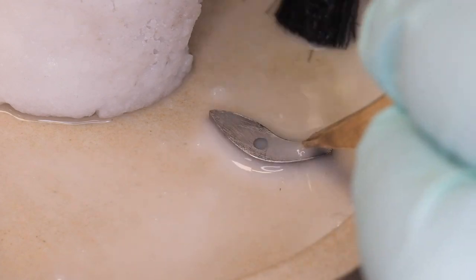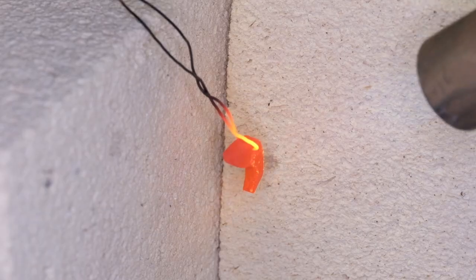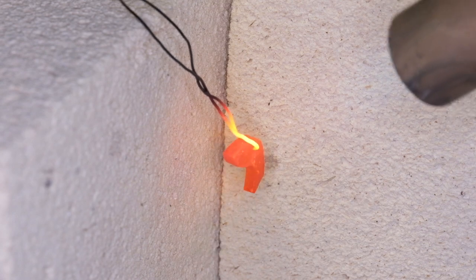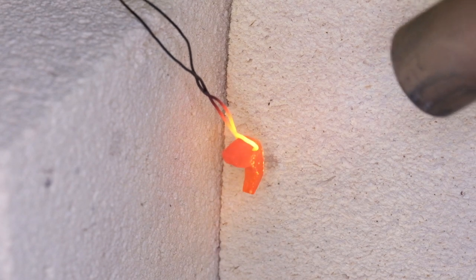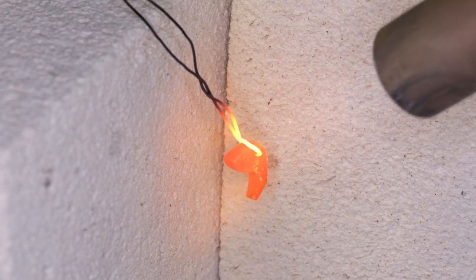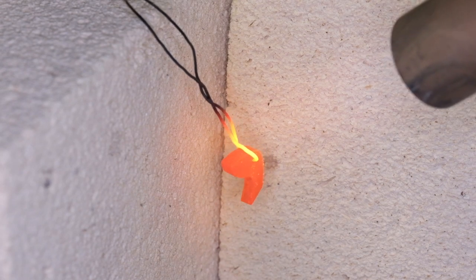The component is now ready for hardening and tempering. To help prevent fire stain — that's the oxide layer that builds up on material when you heat it — I use a borax based flux. We heat the component to bright orange and then quench immediately in cold water.